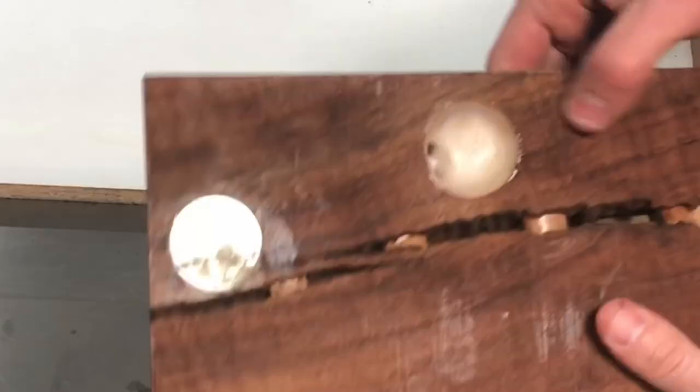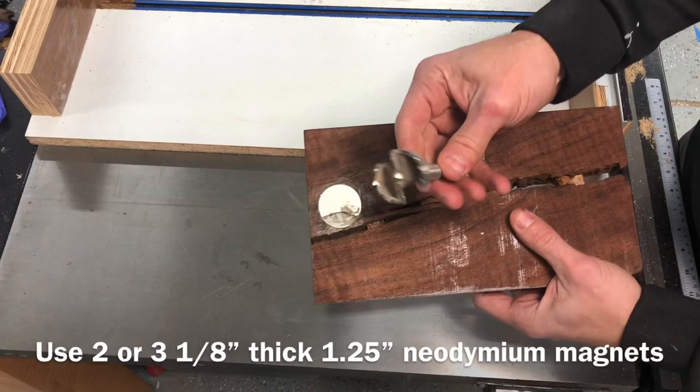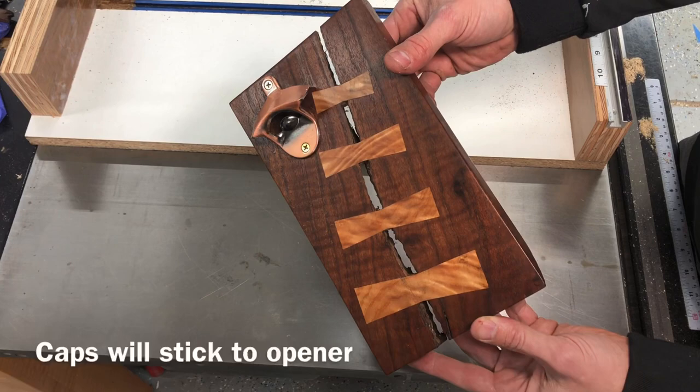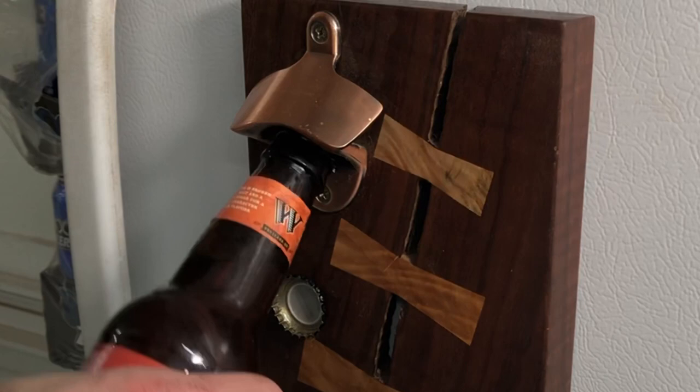I apologize in advance because I couldn't get the material shipped in time due to this whole virus business right now. So I'm going to show you how I made this bottle opener. All I did was use a Forstner bit to drill an inch and a quarter inch hole as deep as I could for the lower one, and as shallow as I could for the upper one, so that I could still fit two or three of those rare earth magnets in there. The only thing you need to be cautious of is don't put your top magnets right behind your bottle opener — that causes all the bottle caps to stick to your actual opener and won't allow them to drop down. I used quite a few magnets in this one, so it will hold a ton of bottle caps.